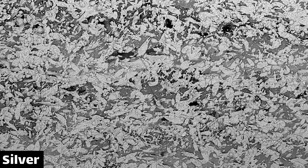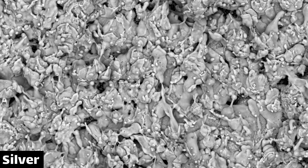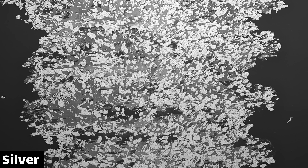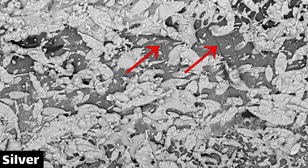You can immediately see that the deposited film is not a clean continuous layer — it's actually thousands of small blobs of metal splashed around like paint. This pretty definitively tells us that the mechanism of action is not a plasma process like sputtering, but rather a molten droplet process. If this were sputtering generating metal ions that adhered to the glass, we'd expect a really consistent thin layer, or at least very finely grained metal.